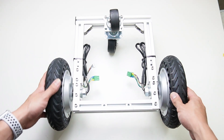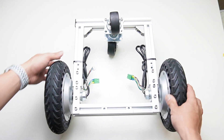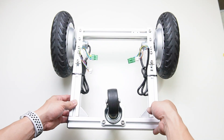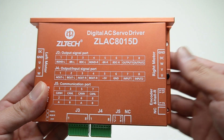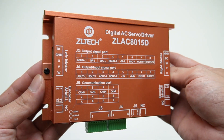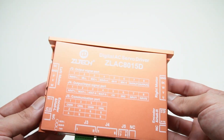I think this would be another fun project, so if you're ready let's get started. For the robot base platform, here is the brushless wheel hub motor with an in-wheel encoder. I'm using 30 by 30 millimeter aluminum frames and there are two caster wheels in front so the car could flip over and still continue driving. This motor comes with a motor driver set ZLAC8015D and I'm going to use RS485 for the communication port.